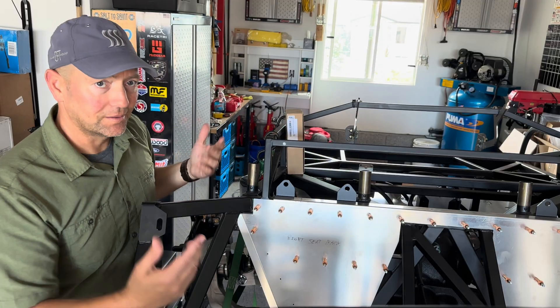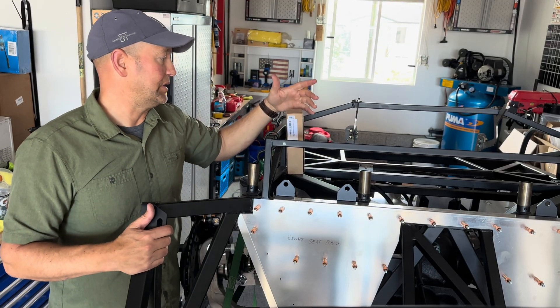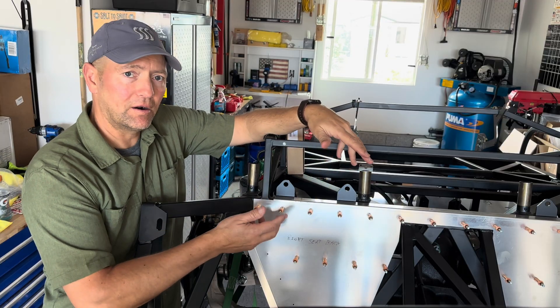Sometimes the post is broken off and the gun can't grab the remaining portion. In that case, I'll wiggle it back and forth a little bit until it breaks off through fatigue. When it does break off it's either flush or just inside, so there are no sharp edges. It's not ideal, but it works. That's my first note — the rivets are not real high quality, or maybe it's the manual rivet gun I'm using.